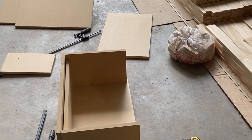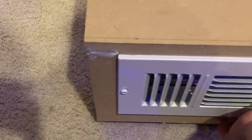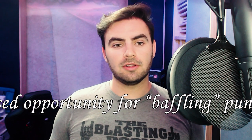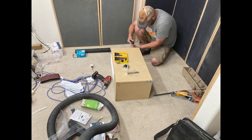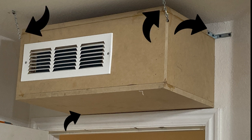It definitely took some doing to get everything to fit perfectly with the double layer of MDF board. The pieces were all attached together and sealed with wood glue and brad nails. The one for the floor vent is actually heavy enough to just sit on top of the vent and seal it down without any kind of attachment needed. The change in sound from the vent was remarkable — it immediately went from pretty noticeable, down to nothing. The one above the door was a little more tricky. The top of the box happened to line up nicely with a stud, so it rested slightly on the door frame, locked into place with some L-brackets into the studs, and was reinforced by a pair of chains also running into studs. That thing is locked in place. I'll definitely get around to painting those baffle boxes one day, but for now they are effective, and that's what I need.